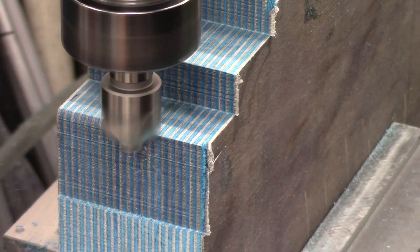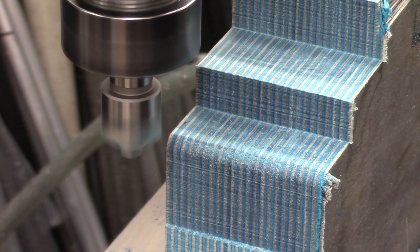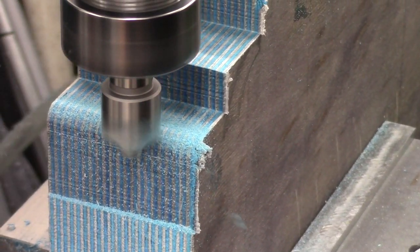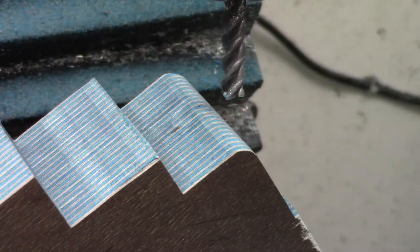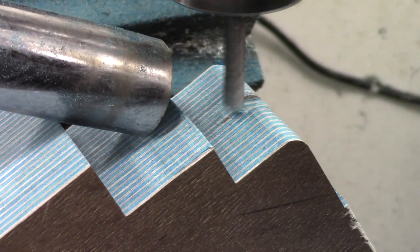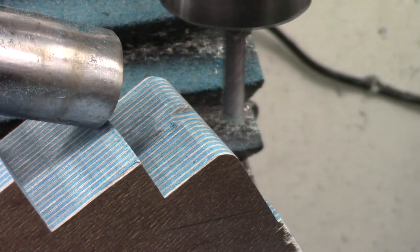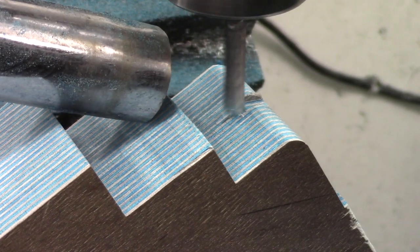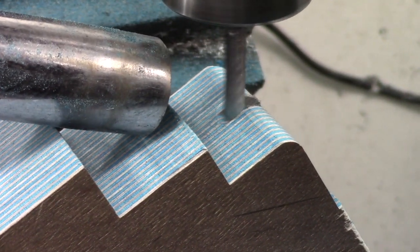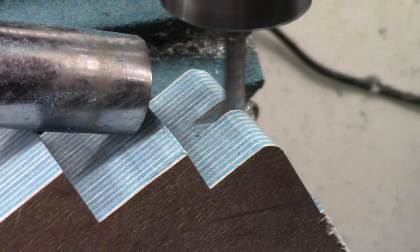Last thing to do in this setup is to radius the front edge to match the rifle. The radius in the pistol grip and in the rifle is 7mm, so we're just coming back with a 7mm radius end mill — the same as we did in the metal — just taking off that front edge. Next up we're milling out the slot for the pistol grip. There's a very good video on YouTube from a stock maker called Tilly's Gun Stocks — I'll leave a link to his channel in the description — he does a very good video on pistol grips, how to do them with routers, and gives all the important information on the dimensions of the slot and a good jig for making pistol grips. We didn't make a jig for this one; I managed to use a couple of angle blocks, set the angle to 30 degrees — which is the required angle — and milled the slot normally. The slot width in our case was 9mm and we got it down to depth.